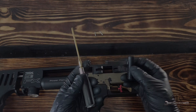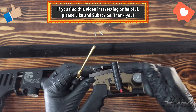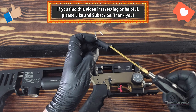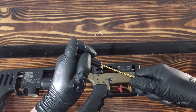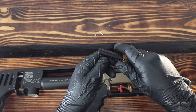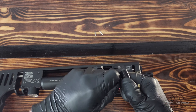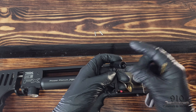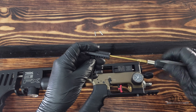And there you go — there's your lever. Now this is where the 2.5mm Allen comes in, because when we flip this over to the other side, as you notice the handle is in the wrong direction. So we take the 2.5mm Allen in here and take this lever handle off. There's your set screw right there. Take it and just flip it over, drop that screw back in, and tighten it up.